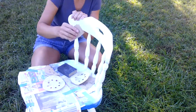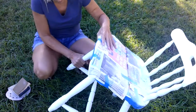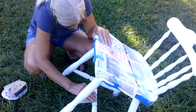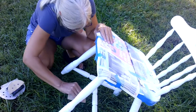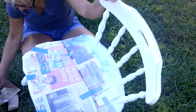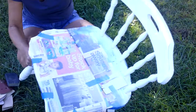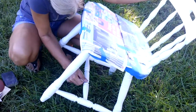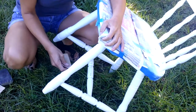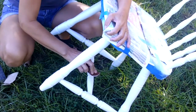After letting the paint dry for at least 24 hours, it was time to distress. I considered leaving just the clean white lines, but distressing a piece can hide flaws, and over time, if the paint chips or gets marked up, it looks like it was supposed to be there as opposed to standing out. I'm carefully deciding where I want to distress — sanding the areas that would naturally have been worn from use.